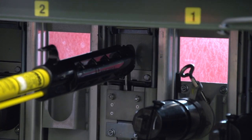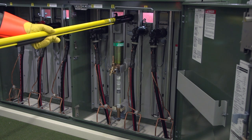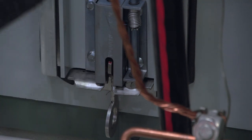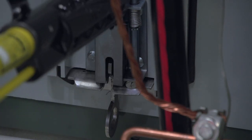Secure a shotgun stick to the pull ring at the top of the transfuser mounting. With an outward pull, rotate the transfuser mounting end for end to return the fuse to the component compartment. Make certain that the mounting latches in this position before removing the shotgun stick. Then disengage the shotgun stick from the pull ring. To verify that it is securely latched, push against the bottom of the mounting with the shotgun stick.